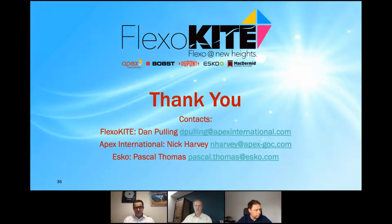And it's quite clear that there isn't a one size fits all, or one fix for all market segments. You know, we do offset coating, we do corrugated, we do wide web, we do label. So what we've been able to do over the time is manipulate and innovate the engraving so that it delivers. We're after a kiss touch on the surface of the anilox, and if we can get that through the transfer without excess pressure, that's where we see the benefits.